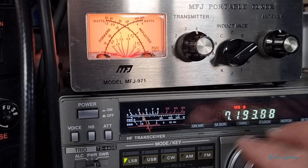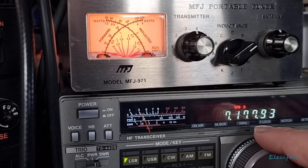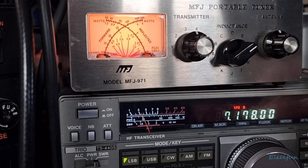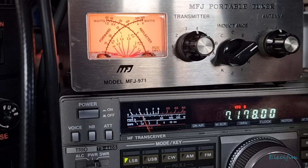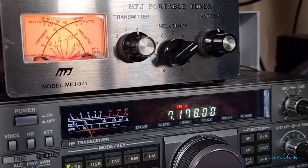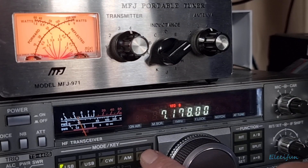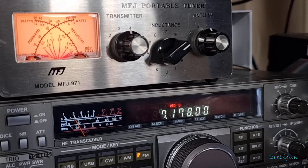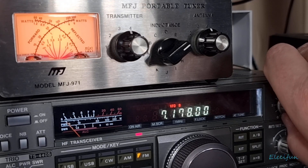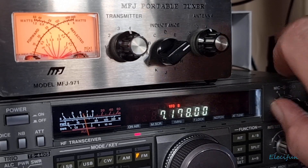So now what I'm going to do is go to where there's nothing - I don't want to be tuning in on their conversation. I'm going to back the power down all the way to zero and key up on carrier mode - we're on a constant carrier. Turn the volume down so we don't need to hear that, and then as I key the mic, we're on air. Start turning up just gently the power - see that, see the SWR go flying up there.